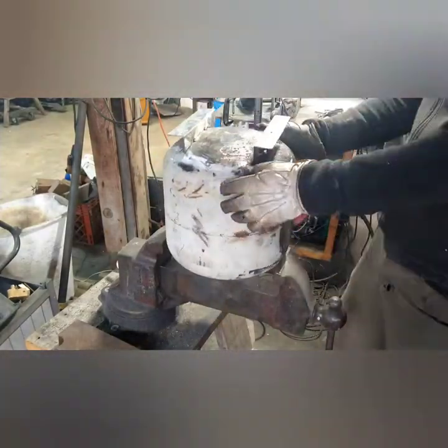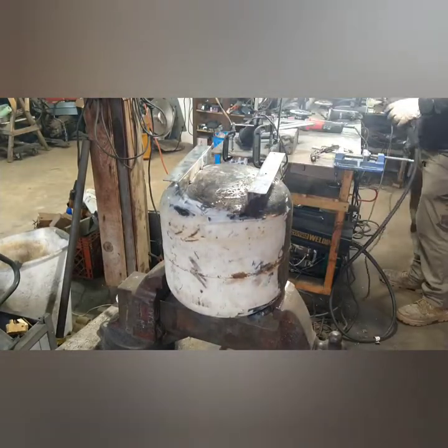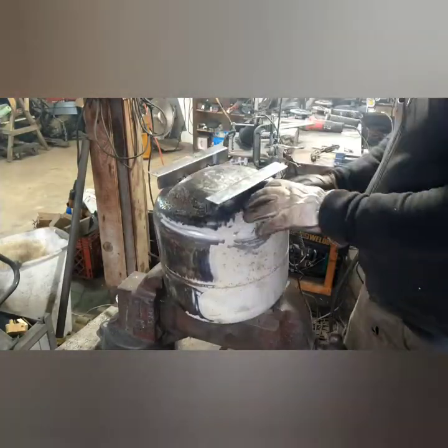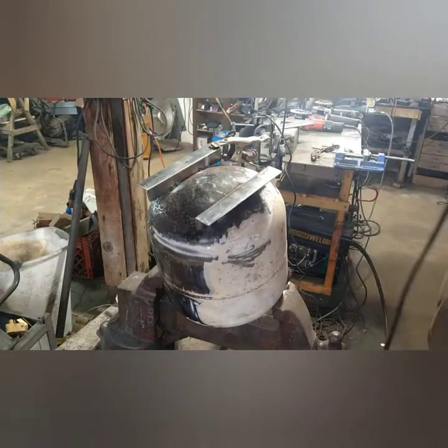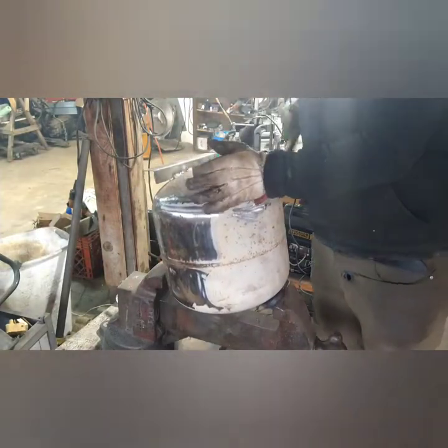This tank was really rotted and corroded but there were no holes completely through it — it was just pitted up really bad. It welded alright. I have a DC MIG welder that I converted and it seemed to do the trick fairly well. For you welding gurus out there, I'm running electrode negative DC and I just have the vise grounded in this situation. It worked out pretty well. The biggest objective to adding these feet on was having something to clamp to.